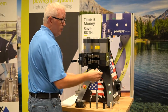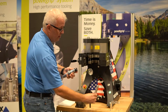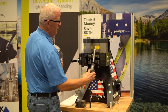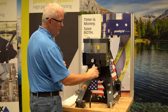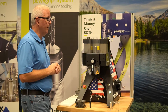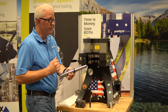We're going to start off with our PG-25 tool holder and PG-25 20 millimeter collet, take our PG-15 extension, and we're going to press this in. Simply put it into the machine and use it as normal — we're going to press it in. It takes about eight seconds for a total cycle, and we are applying six tons of force to that. Now I have my extension already pressed into my PG-25.